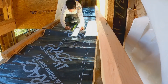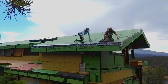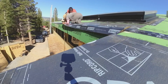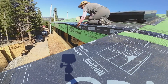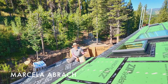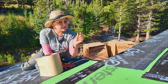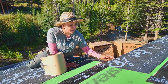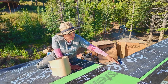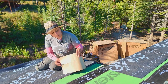You might be wondering why we install the roof detail membrane on top — that doesn't seem to follow shingle style. Here's the reason: if I just fold it down and leave a little hole, water can come up and get on top of my roof. If instead I install the roof detail membrane this way, then even if I leave a little hole, the water might come up but it's going to be on top of the ice and water shield, giving me better protection.